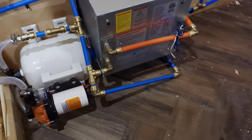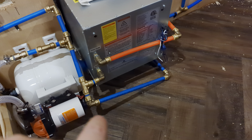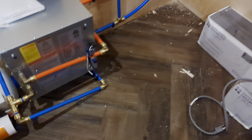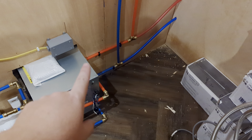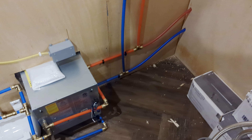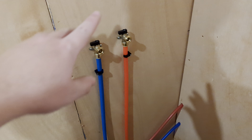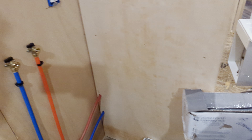From there, it tees off — goes into the water heater, and then goes to the cold for the rest of the bus. I would have tried to use fewer fittings, but I had to make these turns to go against the wall because we've got a big washing machine that needs to go right in this area. So we've got hot and cold running over here, we've got our washing machine hookups, then it goes through the wall and up over the wheel well.